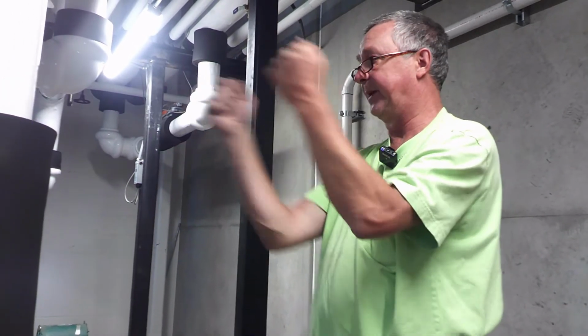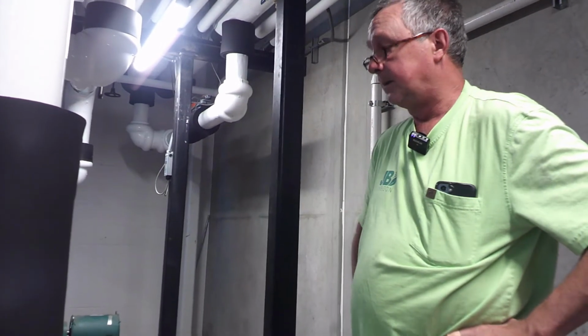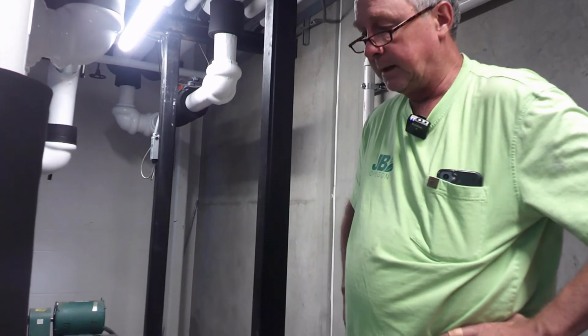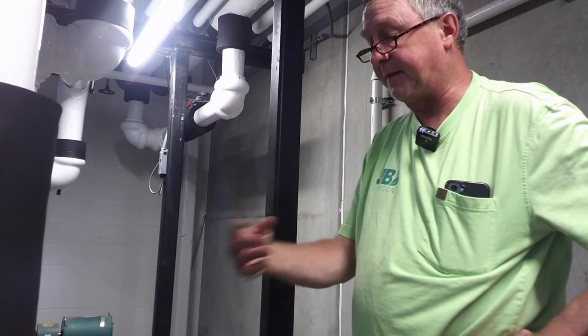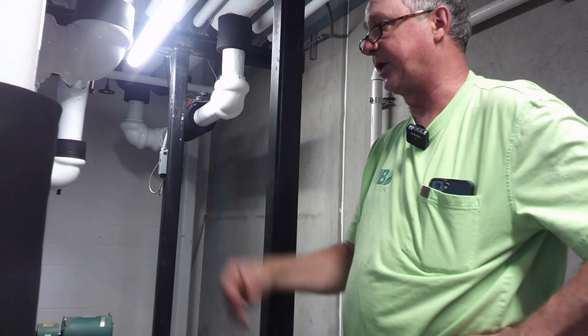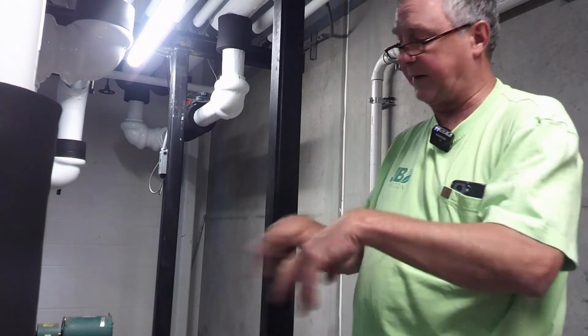You can spin it like a steering wheel. Nice and smooth. Just not a huge ton of it. Between my fingers and I just squeegee it off. It doesn't take much. Because you don't want that stuff getting in the water stream, that could get on the seal face, and then you just destroyed your good work. So just make sure everything's super clean, don't get grease and goop everywhere.